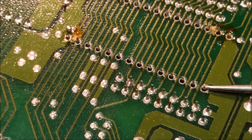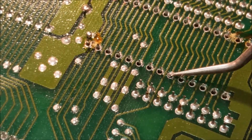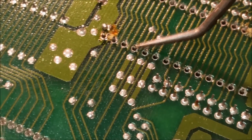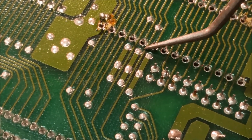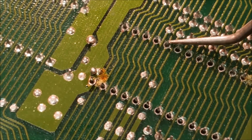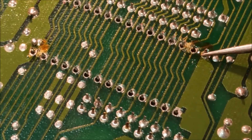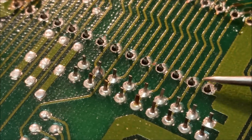Now I've got my scribe — dental pick or whatever — and I'm going back and checking them again. If they move freely they're done. If not, you might be able to push on it, but don't do it too much because if there's too much solder in it you could strip the barrel internally. I'm going to bend the stubborn ones over a little bit to mark them as needing more work, then go back at them again with the solder sucker.